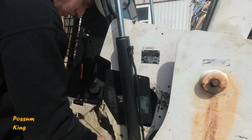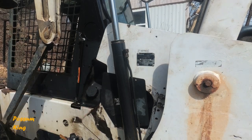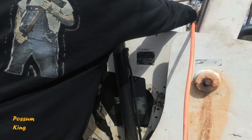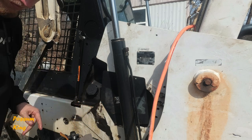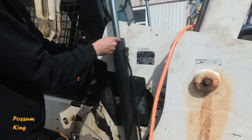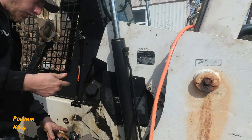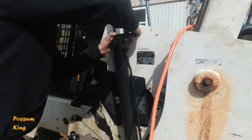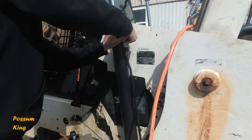And they still didn't want to go on. And this, just spray all the metal out, like all the little shavings. And then lastly, I used a pick because there's pieces of the aluminum where it's stripped off, stuck in these steel threads. And that's pretty much what's stopping the whole thing. I probably could have just pulled those pieces out and been good, but I wanted to be sure.